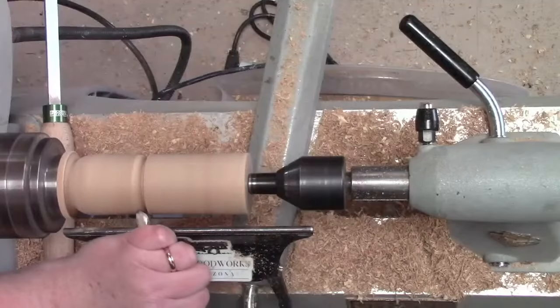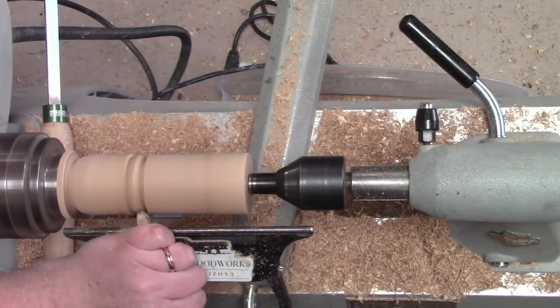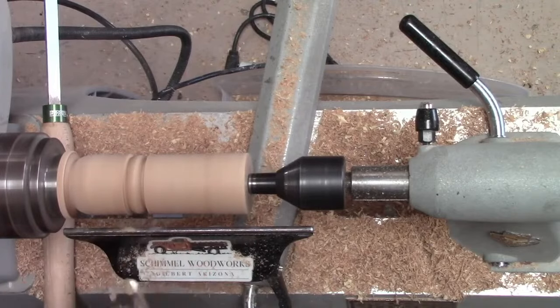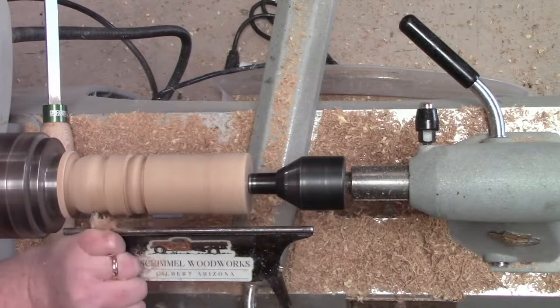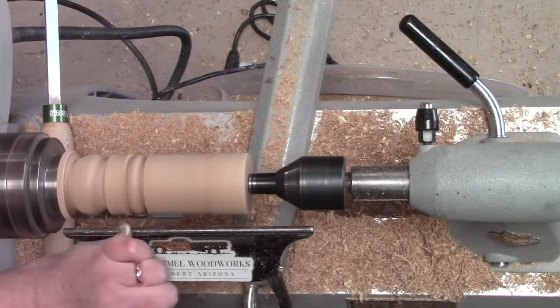But it's fun. We're gonna roll a bead right here and go, yeah, do I like how wide that is? Do I want a little bit longer, shorter, steeper? I like to have a really wide bead on top and a narrow bead on bottom. We're gonna go into a cove.